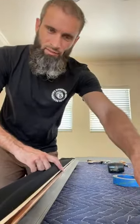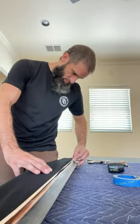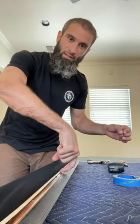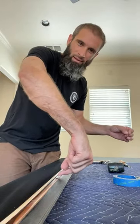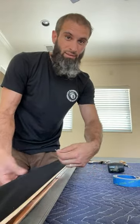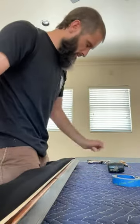I had a little bit of excess right here, but again, it's nothing. Have your blade down at an angle a little bit into the feather strip, which still has something to hit, because I haven't pounded it all the way down. Had I pounded all the way down, my finger would touch the cloth. If your razor blade slips and hits the cloth, you get a hole. Now you have to pull that cloth in further. It might shorten this too much where you can't staple underneath.